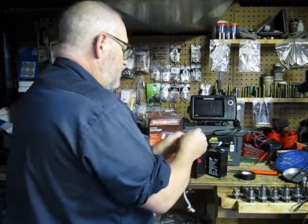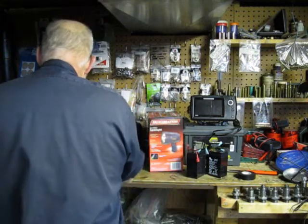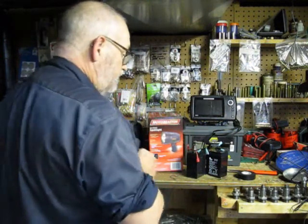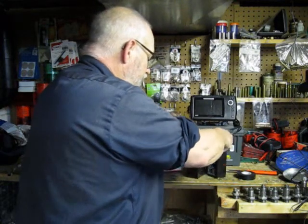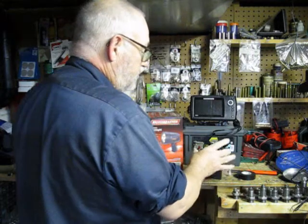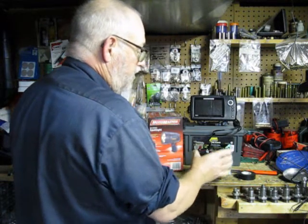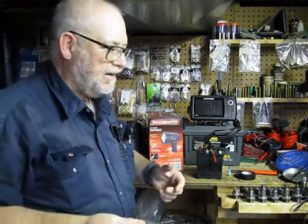When you're done, you undo it, put it away for the next time — because if you ice fish as much as I like to do, once ice fishing season is around, you'll be doing this quite a bit. You hook up the wiring harness you made up for it, and now you have two 6 volts to make 12, and double 4½ amps to make 9. It'll vary depending on what you get.